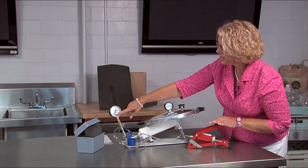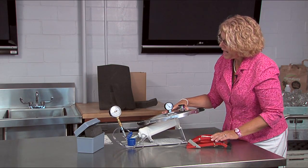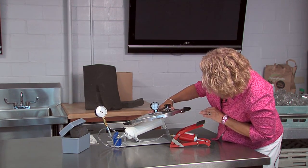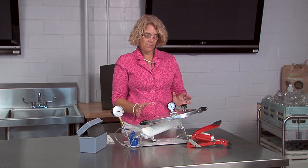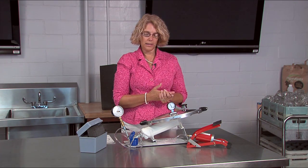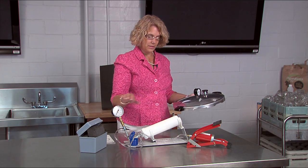This gauge is on zero and this gauge is on zero. I'm going to use my pump and get the Presto dial gauge that I'm testing against up to 10. When I do, my dial gauge should also be around 10. Mine is reading around 11 pounds whereas that one is reading 10, and that is perfectly acceptable because we're giving it a one pound either way, since this is not a closed system. So if it's one pound over, it either truly is or it should be right on. I simply lift this off and the dial gauge goes down to zero.